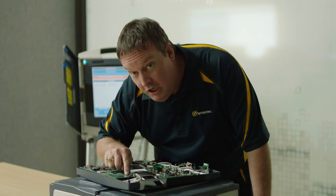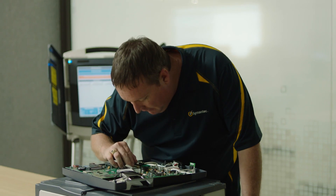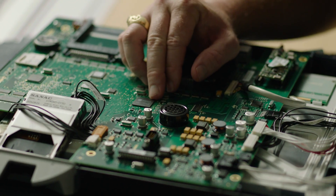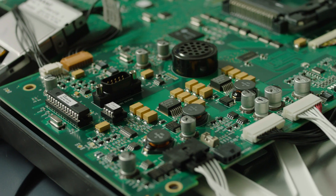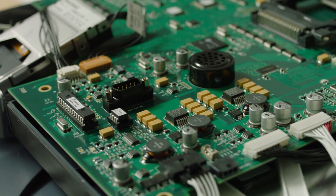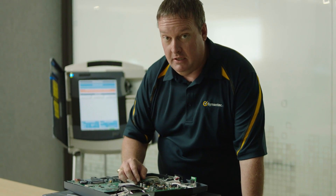All the model numbers are on these chips, which really should have been removed, redacted, or ground down. I can clearly see that this has a one-gigabyte chip, so I'm assuming that's probably on the cache side of it. We have way too much information on here. All of these start to have a piece of the puzzle that you can put together to start formulating your exploitation vectors.